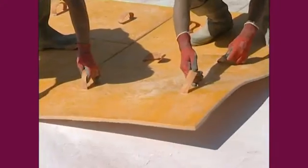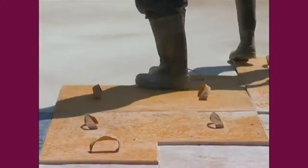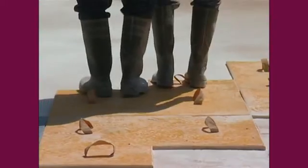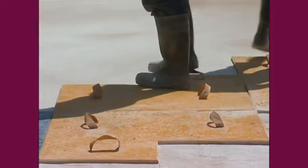That's where the problem lies with Artevia Print. The operator tends to apply the molds by feel. The concrete must be neither too hard nor too soft. You have to check the pressure you apply to the mold properly to make sure you don't deform the concrete too much.